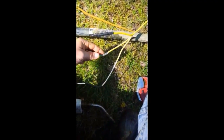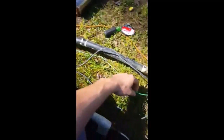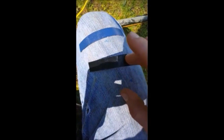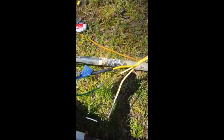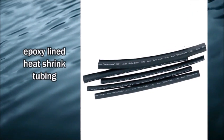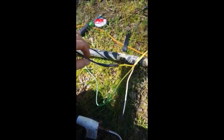The next thing to talk about is wire splices. These are called stacons — they connect your yellow submersible pump cable to the cable connected to the pump. This right here is 3M rubber tape, very good stuff. The blue is just a protective coating — you peel it off and you have a dark rubbery substance on both sides. It adheres only to itself: if you stick it to itself it's stuck very well and acts as a waterproof sealant. You can also use epoxy-lined heat shrink tubing, available at any local hardware store.